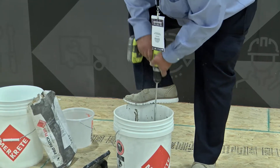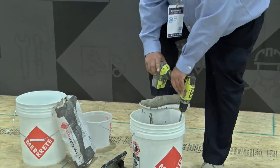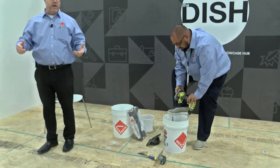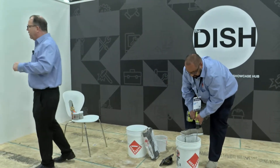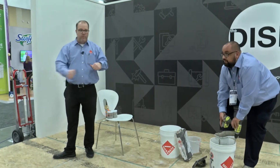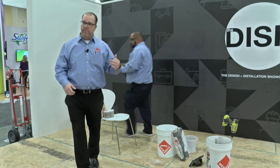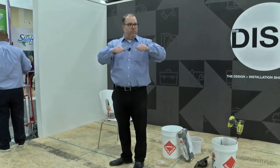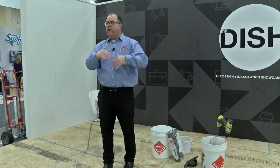It has self-healing technology. As long as it's still in a fluid state, if you touch it with a trowel or hit it with a screed, you pick up the screed and get screed marks — normally you'd have to come back and smooth it. With this product, you don't need to do that. You screed it, pick up your straight edge, and those bumps or bubbles flow right back in. It's self-healing — I can run a trowel through it, it's like parting the Red Sea, it fills right back in on itself. It's a very unique product.